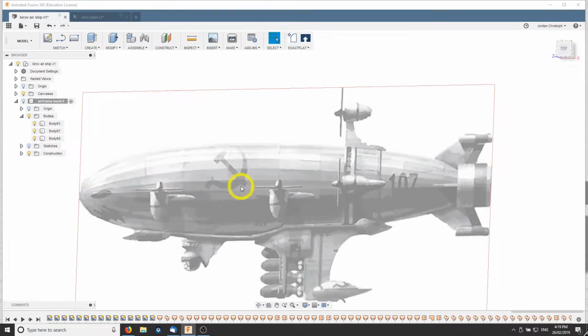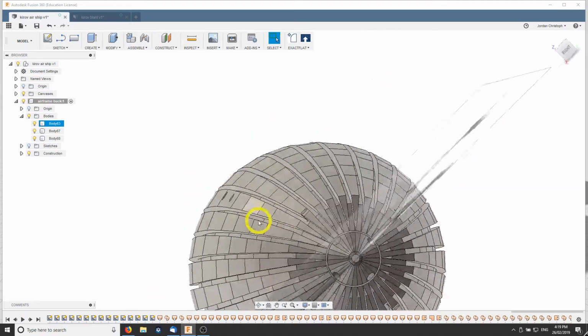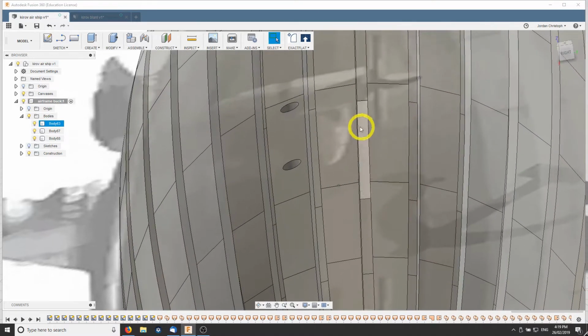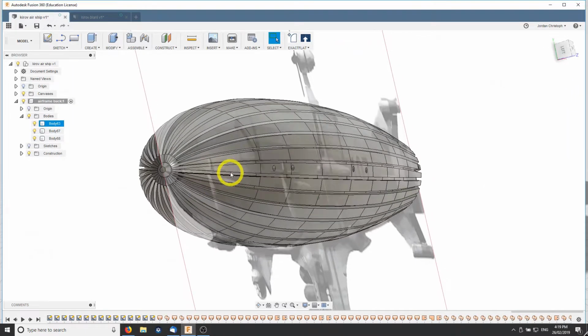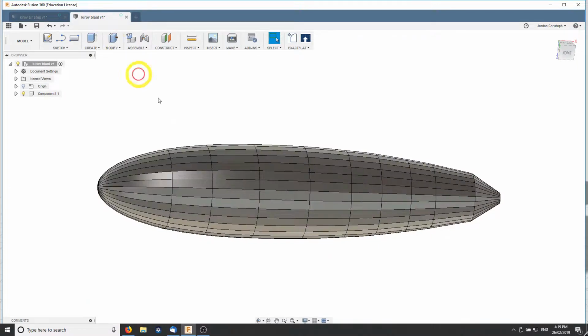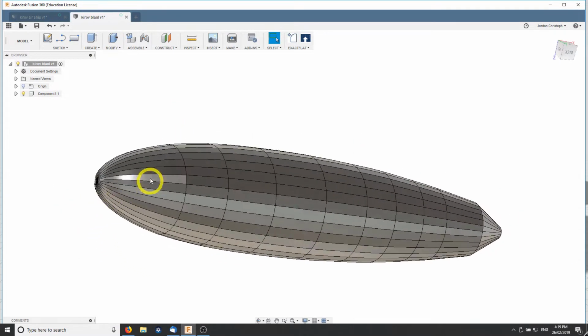So basically what I've done is I've modelled the airframe and I've cut in these slots for the stitch seams to sit into once I pull it inside out. Before I cut in these slots I created a copy of the same airframe. So what I want to do is turn a run of these into a strip I can cut on my mostly printed CNC and add in some seam allowance,